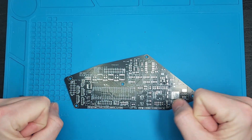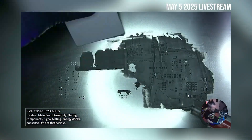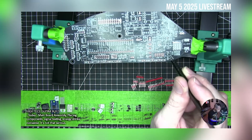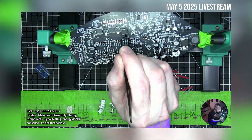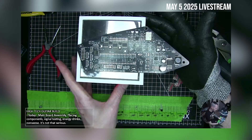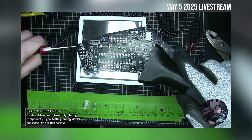Okay, there's just no getting around it — I've got to get this main board done. There are a lot of pads here and I have manually soldered this entire board once before. I don't want to do that again. Thankfully I have a stencil for this PCB, which has all the holes for the pads cut out in the right spot and it's made out of metal. You just stick it right over top of the PCB, and as long as you're really careful you can drag over some solder paste — look how clean that is. That doesn't make it any easier to source and organize all the parts, so I had to spend about a day digging through all of my parts and putting everything on a big piece of tape, which helps me keep track of all those little teeny tiny pieces. Once I applied the solder using the stencil, I can just pick and place all of those little parts super quick.